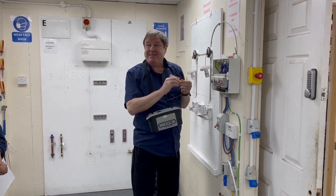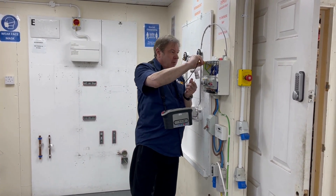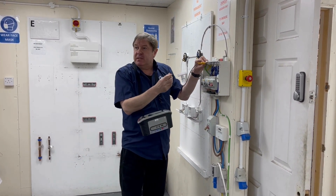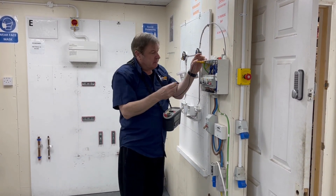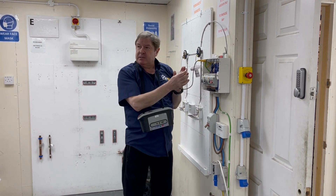I'm gonna use a CPC and shove this thing right onto the brass so that we're not onto those loose screws. Loose screws mean high resistance — they're waggly. So I get that right the way through onto the brass, and then I'm going to go down to the bus bar that is the appropriate one.